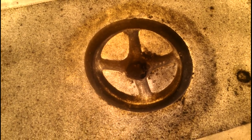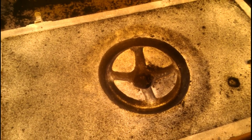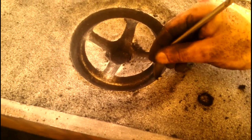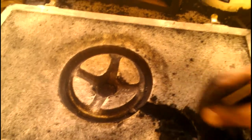Anyway, after this — assuming the mold hadn't broken up — we would be just about ready to close it up. But there's one more thing: the sprue comes down here and we need to cut a gate. So we come in something like this and dig out a little groove like that. This is where your air comes in really handy. This is just a tester so it's not a big problem.